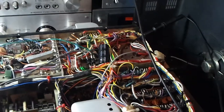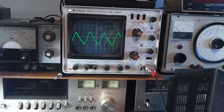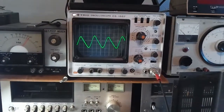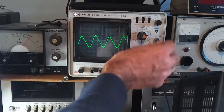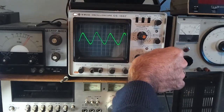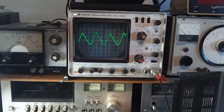Looking up at the oscilloscope — that's the ripple on the first part of the filter. The measurement doesn't have to be too precise, but it's about three divisions there. It's half a volt per division, so it's one and a half volts, sitting on just under 14 volts. So that's on the first part of the filter.